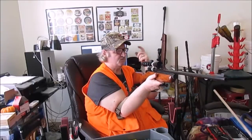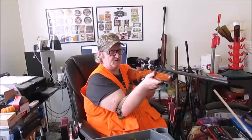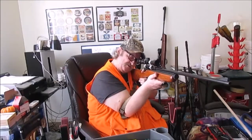The shaft for the hammer spring is on the cocking spring. The spring keeps them put together, and you put the washer on that rod that's machined into the front of the cocking piston, which fits into the hammer piston up here. So the washer goes in the one back here that compresses that hammer spring of mine. Check it out. Almost no kick. You can kind of feel it like a 22 long, maybe.